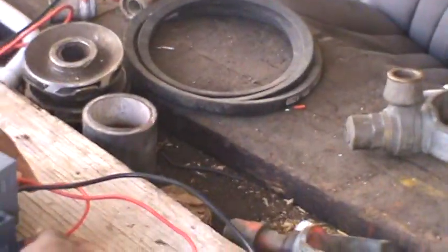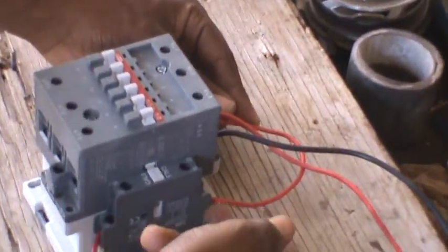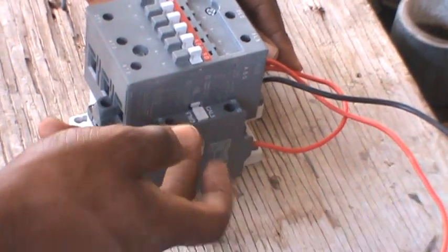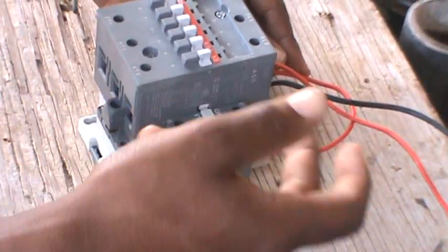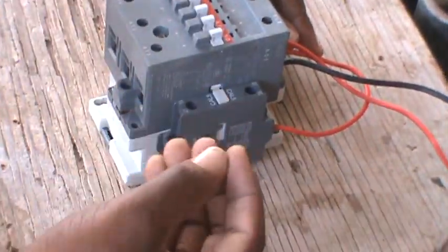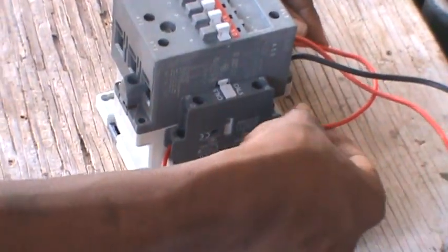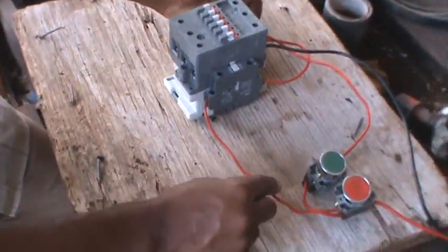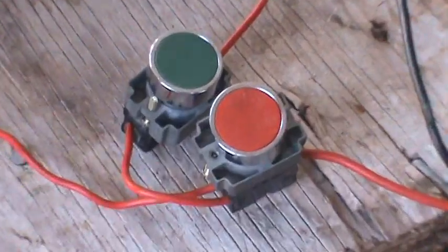So you come from your M coil, which is your contactor coil, down to your normally open auxiliary, which is normally on the bottom. The top is normally closed — you don't want that. If you wire it on the top, the contactor is just going to slam in and out repeatedly and it's not going to work. So you always connect to the normally open auxiliary on the bottom, bring it back out, and go back to your stop button. That completes the circuit.